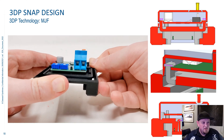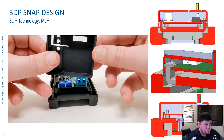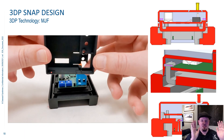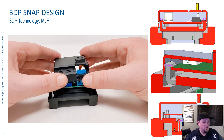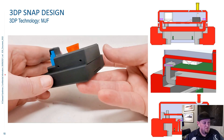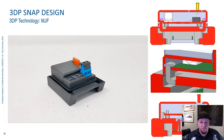You can see these snaps are kind of U-shaped or L-shaped in that they can flex both ways. There are little ramps with ledges on the edges of these snap features. Before we were flexing them open to get the PCB board in — now we're flexing them in to get this cover on. Everything lines up and snaps into place. In the final model, those little holes won't even be there — the goal is to make it very difficult for anyone to get into this after it's assembled. Once it's put together, it's never meant to be taken apart again.